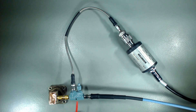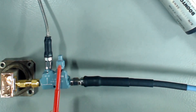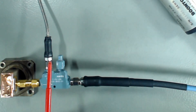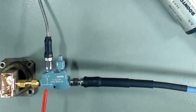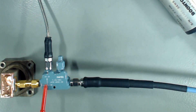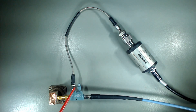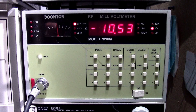What I have here is a directional coupler. Essentially, most of the energy passes through, and a little bit of that energy gets coupled onto these two ports. The incident energy goes into this termination. The reflected energy goes through this port. What's coupled is minus 30 dB from the main signal — only 1/1000th of the reflected signal is sent here. We sample that power into this power sensor, going into a Boonton 9200A power meter.